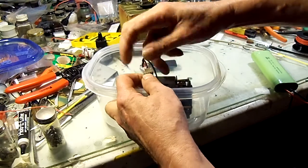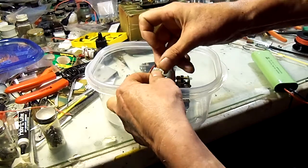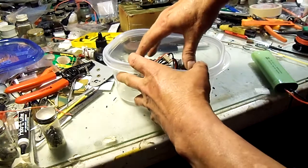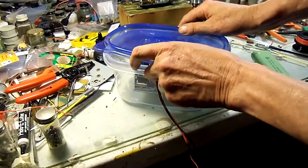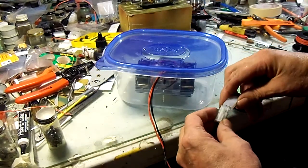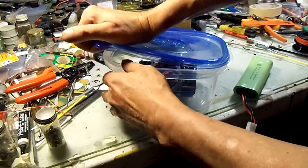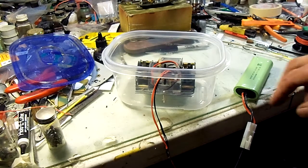I set it in there, and here's why I've got the five-pin connector. I just plug in the motors, one on each side. When the new gearboxes come in and I start doing this, I'll put the oil in, put the top on, plug it into a battery, and let them run in the oil for about an hour. Eric says about an hour — the battery probably won't run that long, but running them for one battery length is probably a good reference.